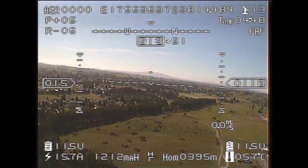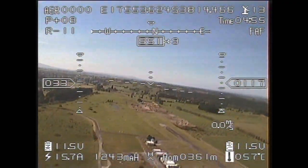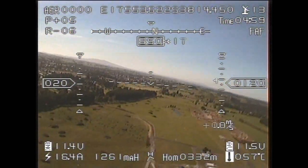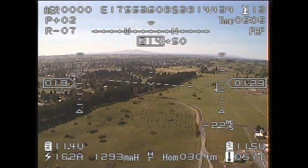Notice that we're down to 16 km/h — in fact, at one stage we went down to about 13 km/h, heading into this very, very brisk headwind. So I've opened the throttle a bit; we're up to 16 amps now, trying to get a bit of ground speed. It's very slow forward progress in this extremely strong wind. We're now 300 meters from home.